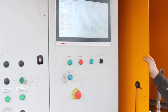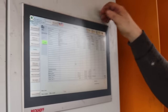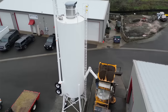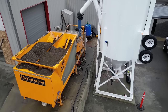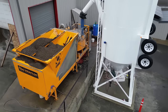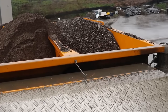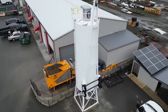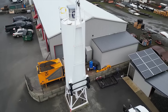A concrete mixing setup like this is known as a batch plant, and they can be really big. This one's on the smaller end, but it punches way above its weight. The job of a batch plant is to mix all the different ingredients to make concrete. This silo holds cement, which is a very finely ground Portland cement — think of it like a powder, and the silo keeps it dry. Then it adds it along with the rock and sand and of course water, mixing it all together in the exact quantity you ask for. The machine also adds any other chemicals or fiber you want. For the products they make here, they also add a plasticizer and two different types of fiber, which you'll see in a minute.